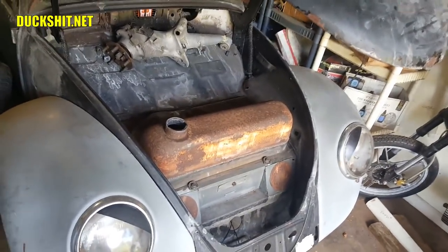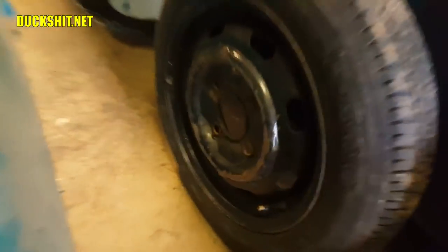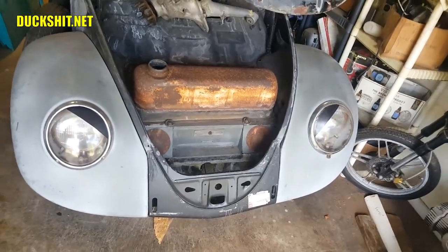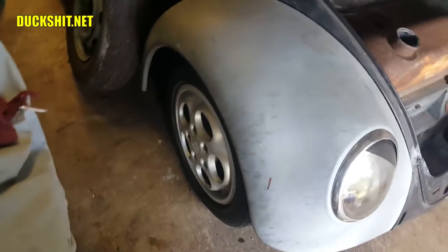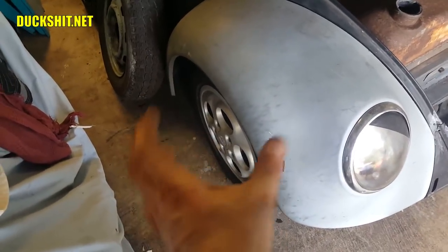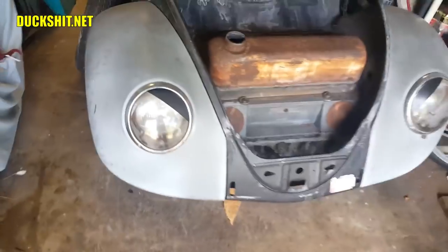One of the discussions we did have is that the bolt pattern on this is now 5x130, and the spare tire that I demonstrated is a 4x130. So I'll have to run some kind of adapter, or at least leave the adapter bolted to the spare wheel, or I can get a spare tire from a 944 or a 928, which probably is a good idea anyway, because some of them are 16 inches. And one of the concerns that I have here is these are 16-inch wheels. And since I put the 944 braking system on here, I need to make sure that that wheel is going to clear the caliper and the disc that's currently on there. So I might need a bigger wheel.